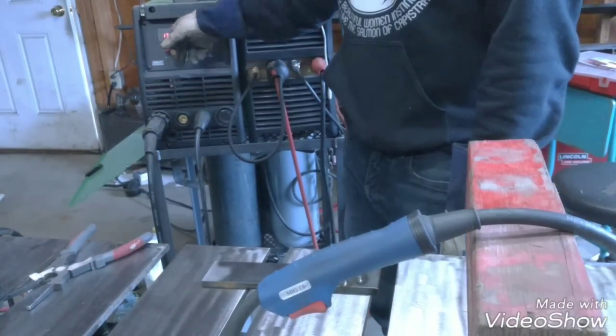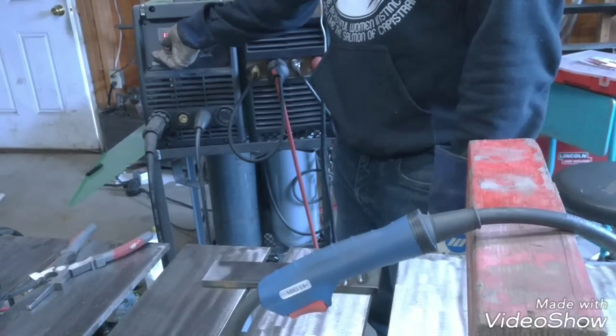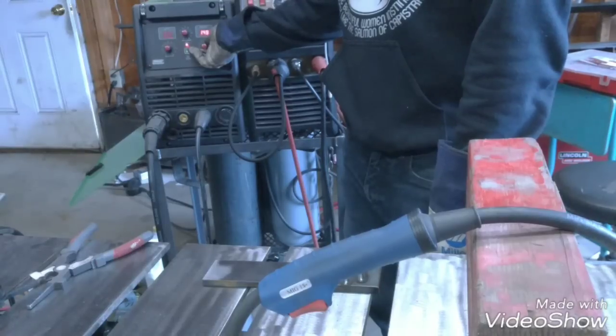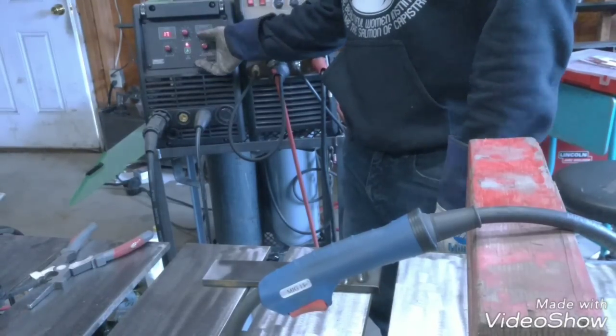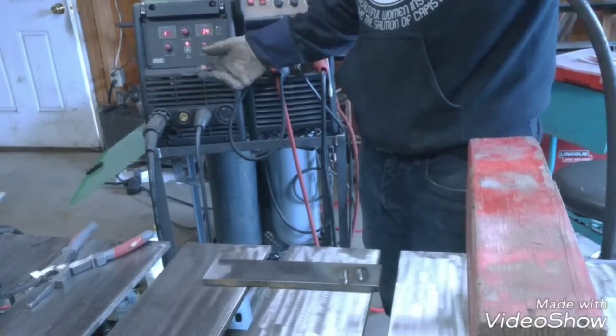What I'm going to do is turn it up half a volt each time. So 17.5V now. I'll go down to whatever the start of that one was — 124 IPM — so we'll start down there.